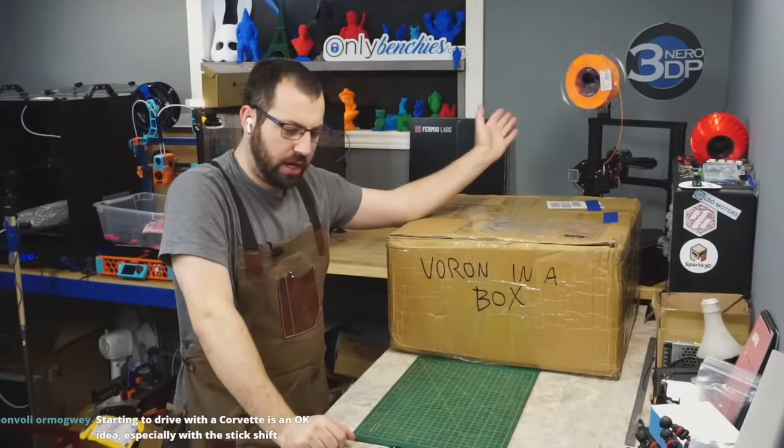And there's like a little gap here where you can kind of see the ball bearings. Smush the grease in there, use like a pin to try and push it in, move it around and just get as much grease in there and you're good to go. High quality real rails come with grease ports on it. These don't. It's obviously easier on the bigger rails than the MGN9s, but yeah.